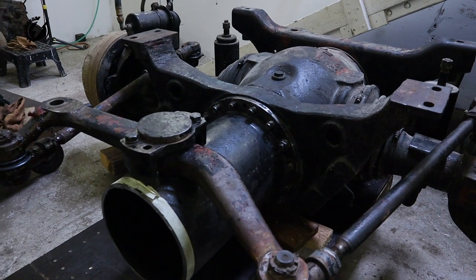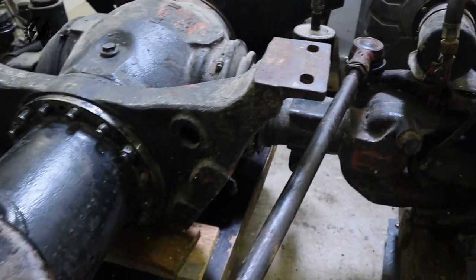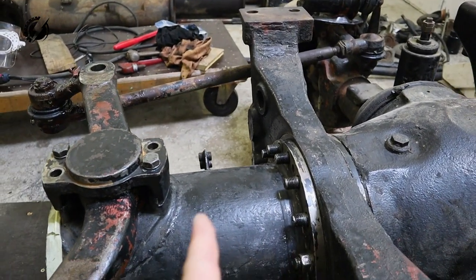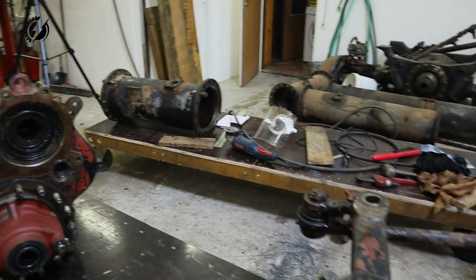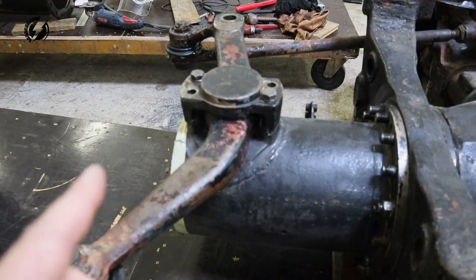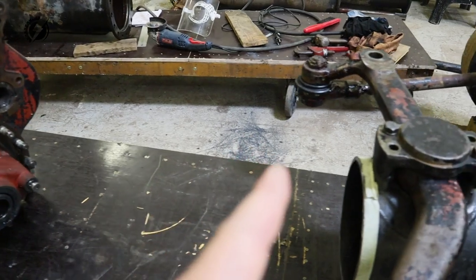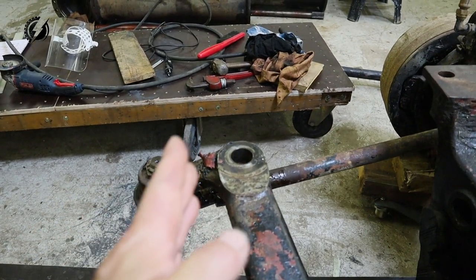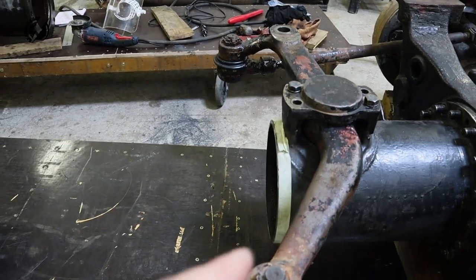Okay guys, I mounted a tube and steering to the axle, and connected the steering rods to the steering arms for each wheel. This distance is going to change because the lockable differential we are going to use is over there and it's a little bit longer. But this is the last time I can actually adjust and find out how short the distance to the T-case can be, because as you can see, this steering main arm can interfere with it at the maximum positions on each side. So we'll see how it will work.